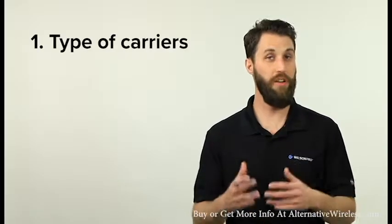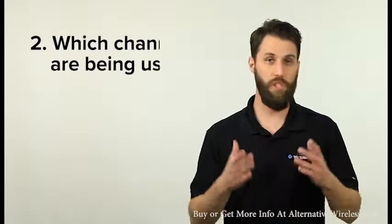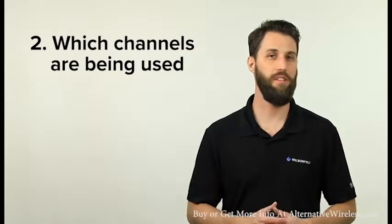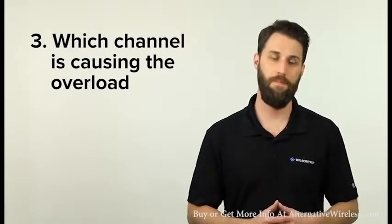You'll need to know which carrier or carriers are used within the building. You'll also need to know which channels those carriers are using. And you'll also need to know which channel is causing the overload. A signal meter is the perfect tool for the job.